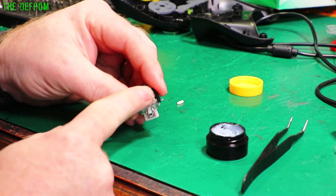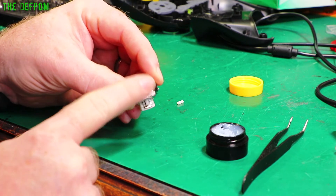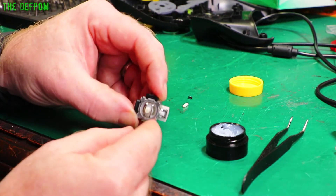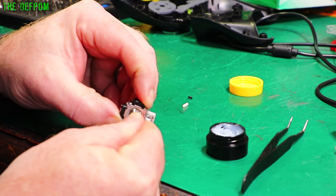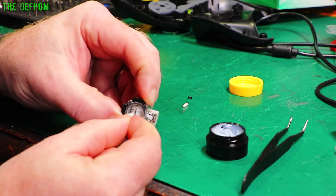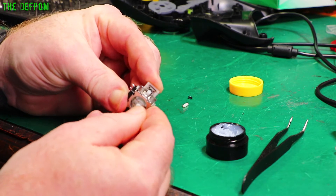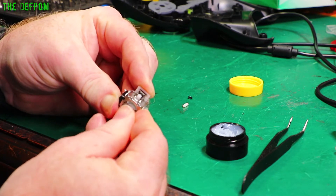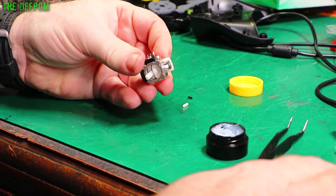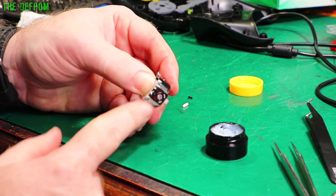Does it work? Ish - yes it does, but it's very stiff. Oh it did work until just then. The screw is affecting how much it can move - it looks like that screw might be a bit too long, it's just pushing it open. If I hold it down it will actually work. It's a little bit too long - I'll cut a little bit more off and it should be okay. Alright, that's freed up a bit more now and moves more easily. So I'm just going to bend all these little tabs back over again using my side cutters.